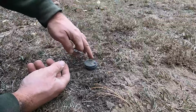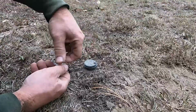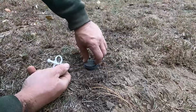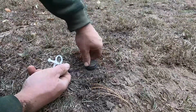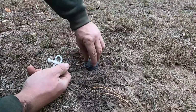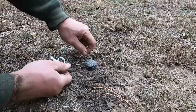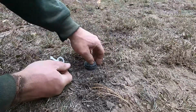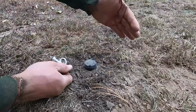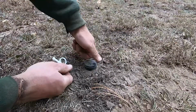So we've got 3 basic slots in it that you need to know about. This arrow right here is what direction the spray nozzle is going to be shooting in, okay? And it rotates back and forth all the way to the right, all the way to the left. So right now you can see it's going to shoot out this way over to that way, okay? So that's the most that it's got. Now this is adjustable on one side. You can only adjust the left-hand side, basically counterclockwise, how far it turns. The clockwise is a fixed position. So anytime you adjust these, you start with turning it.